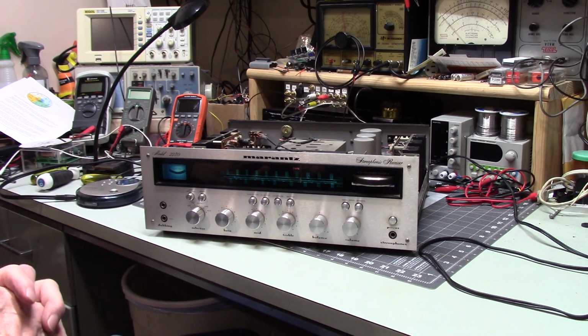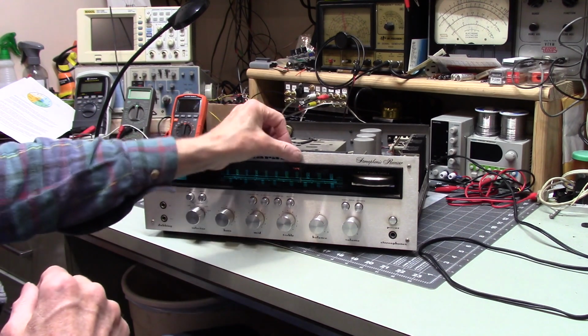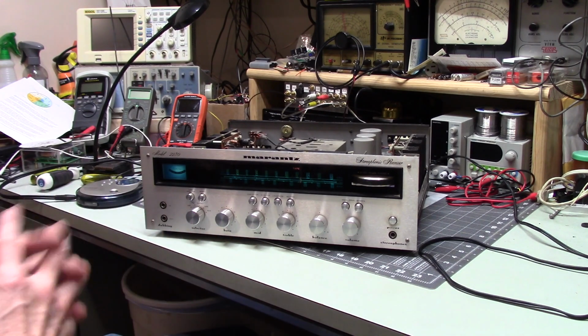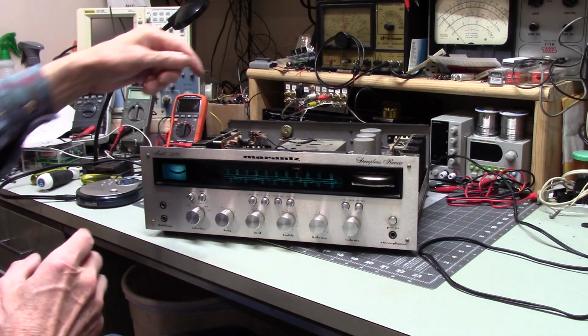Now, I can't imagine any accessory drawing that kind of current that would cause that fuse to go bye-bye. So let's see, 60 watts is on the switched one, so I think that'd be half an amp. So who knows? I mean, people do some crazy things. Do fun things like plug your electric heater into the outlet in the back of your stereo. Sounds crazy, but there are people out there who are crazy. Interesting. Yeah, so I have to order the right size fuse, but under normal conditions with nothing plugged into the back of it, I don't think it needs it.